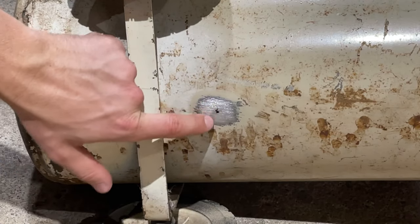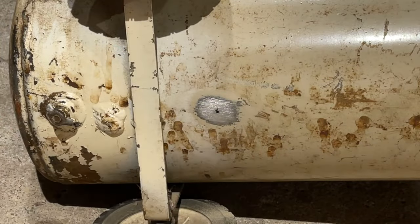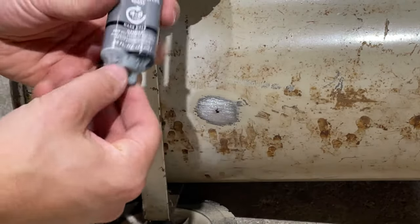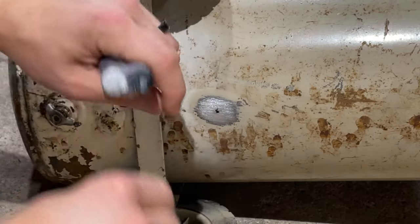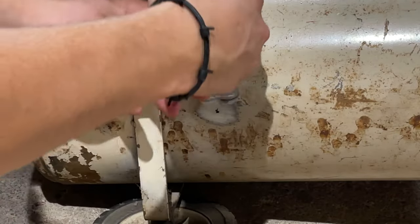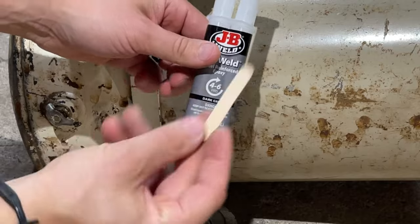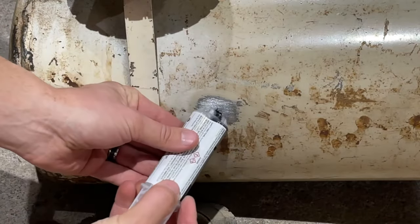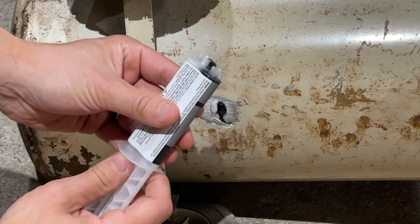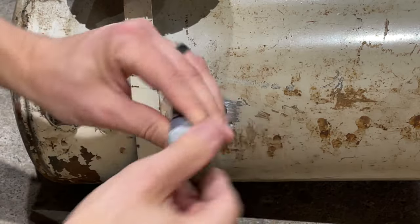You can see I took all the paint off much faster with the sandpaper, and then I'm going to smooth it out with the steel wool. There we go — there's our hole, and you can see it's a pretty large hole. Now we're going to open up the JB Weld. This is very easy to use: twist the cap, take it off, push this plunger right on there, and allow it to touch right there. We'll use the tool that came with it — if you've lost it, you can use a popsicle stick. Get it right up here above the hole, pull the plunger back a little bit — this is a little pro tip — then you can put the cap back on and you have no waste.